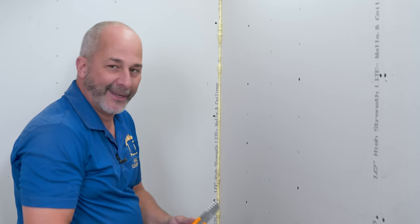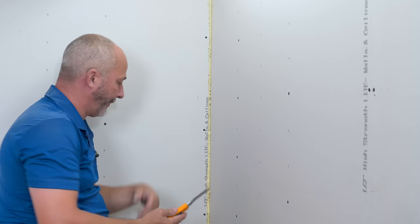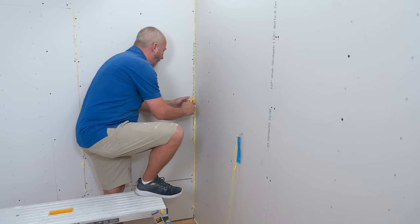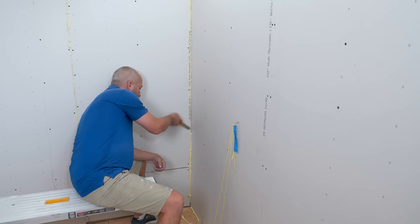This is really convenient. At the end of a long day when you put all your drywall up and tomorrow you're going to tape — this is the best way to do it. Don't start the day making a 20-minute mud and filling all your gaps and waiting for it to set up and all the mess that goes with it. Finish your day with a can of spray foam, and then when it's time to drywall it's really super simple.